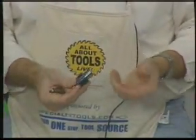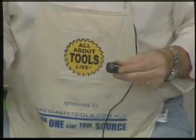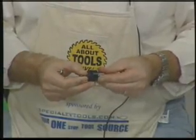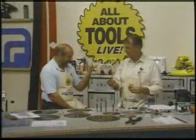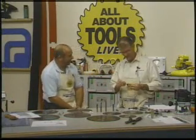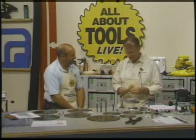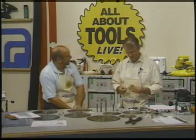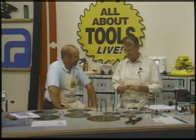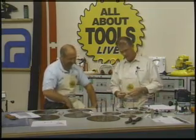Usually when your collets are brand new and the bits are new, you always notice they tend to release, just drop right out. Right. It's as they get older that they tend to start to freeze up in there. You've noticed that, haven't you? I know exactly what you're talking about. And it goes bad on you. So the ability to get your bit out is important. Could you use lube on that? That's right. The ability to get your bit out is important. Right. So you may want to talk about that a little bit more.